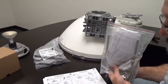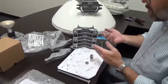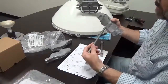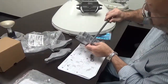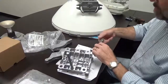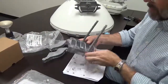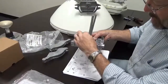We're going to take the clamp casting and apply the first two bolts. As the drawing shows, we apply a bolt and leave approximately a five-millimeter gap — a little bit of play — and do the exact same thing on the other side. They recommend greasing these components so that if you need to remove them later, you can. Both bolts are installed with a gap, so these are finger tight. No need to cinch them down yet.